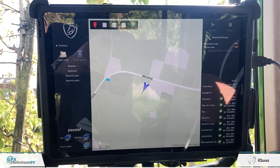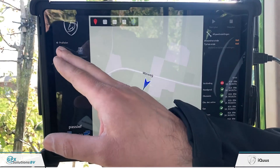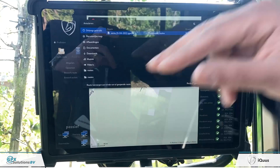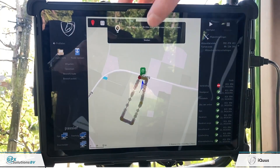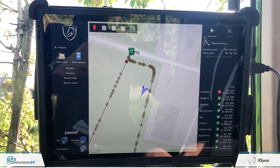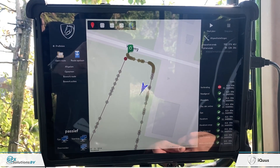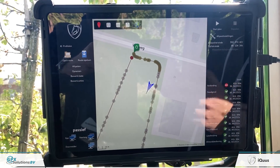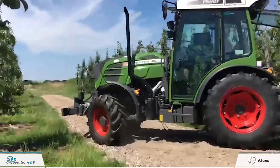We start by recording a route. By recording, we capture the route based on waypoints. I will open a route so you can see — as you can see we have green and grey dots. We drive the straight lines based on the GPS system on an AB line, so we always drive the same lines and have no steering corrections once we have a route.